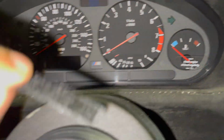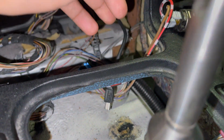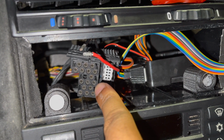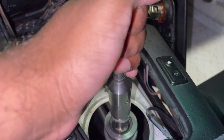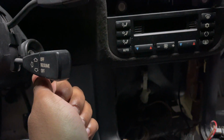Okay, so the Raspberry Pi is being mocked up. I've got some Velcro to put on there so that it doesn't move, but that's essentially where it's going to sit. It's connected to this USB cable that gets routed down. This will connect to the Arduino. And then the red and the black are going to go into the switched power and ground right there. Then the display is going to go here. Faceplate's going to go on. And then I have to double tape, stick on the piece of hardware I made, plug in the Arduino, turn the key, and then it should be good.